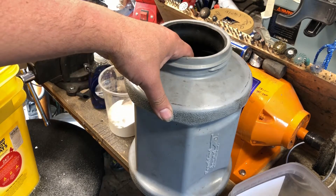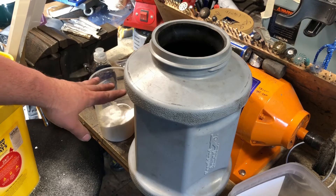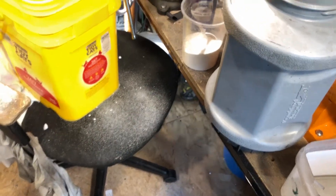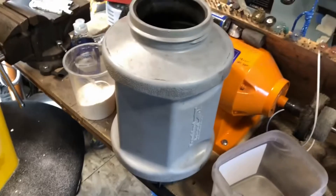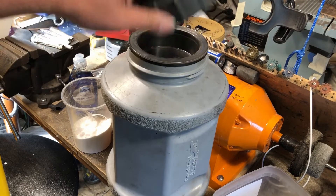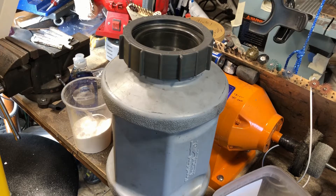Depending on how the pieces look, I'll take out one or two pieces of that Scotch-Brite pad. And then I'll go ahead and put in another teaspoon of borax and another healthy squirt of Dawn, and then run it for probably about two hours. That should finish it off. I got a pretty good mess in here — my LED light came down. It's been in here banging for months and months. But that's kind of how I'm setting it up. I'll fill it up with water, get it tumbling for about 45 minutes, dump it, and then put it in for about an hour to two hours depending on how it looks.